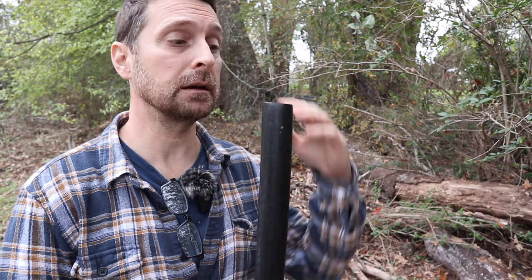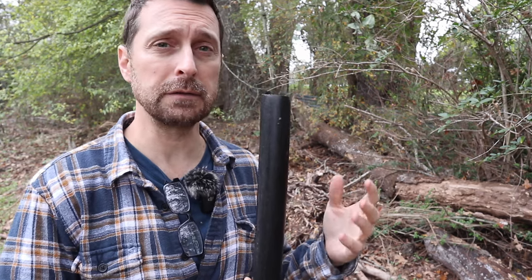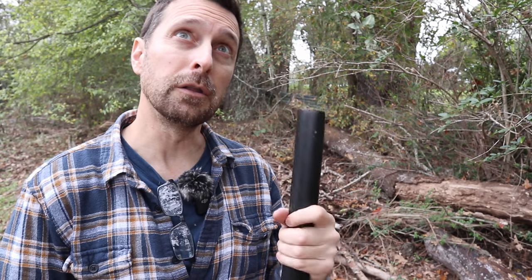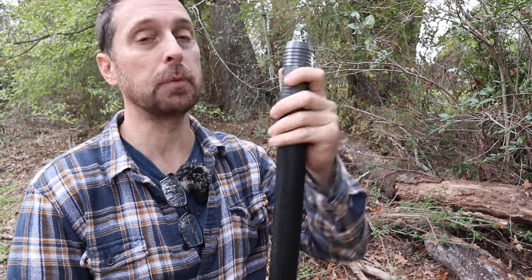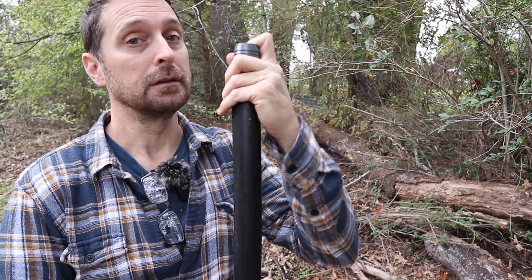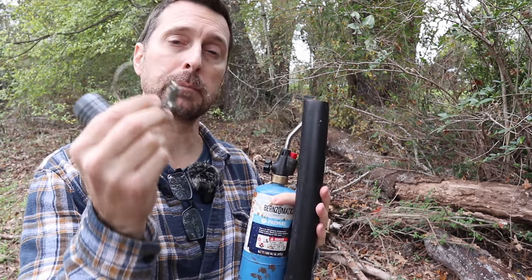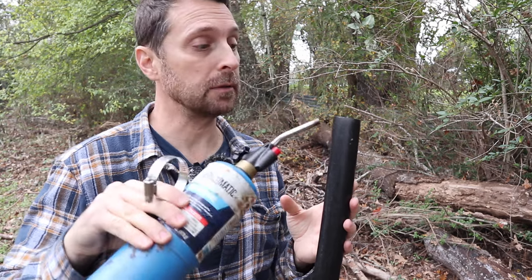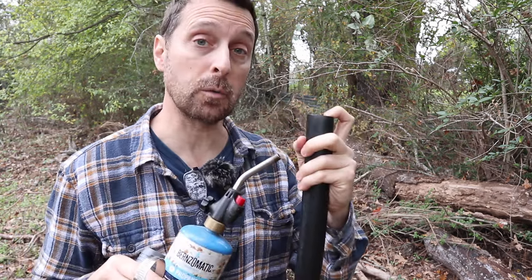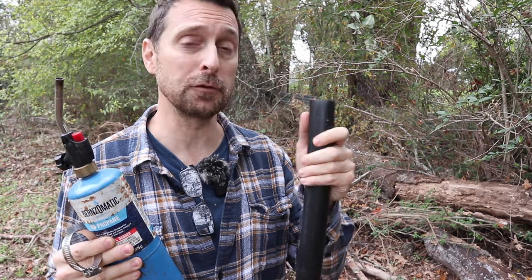We're putting our poly line in and I need another section to go on the end of this. In my opinion this is a bit easier than doing PVC, just because it's quite flexible — although when it's colder it's a little more inflexible. You need to put these barbed connectors in the end of it, but since it is cold you're not just pushing that in. So what you need to do is heat up the end of it with a torch, then secure it with a stainless steel hose clamp. Make sure it's a stainless steel hose clamp because it is going below ground. And make sure when you're heating up the plastic, even though these are quite thick-walled, don't melt or burn the plastic — it's a water line and you'll be in trouble if you weaken it too much.